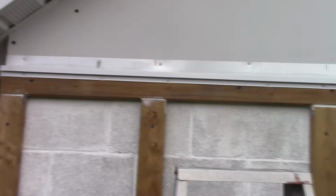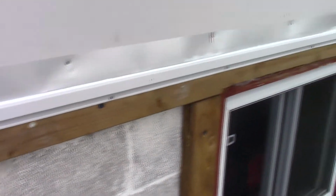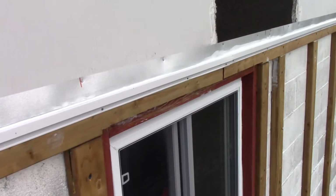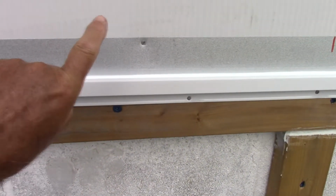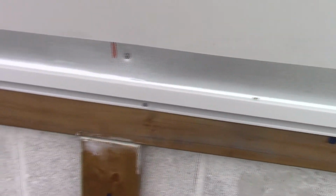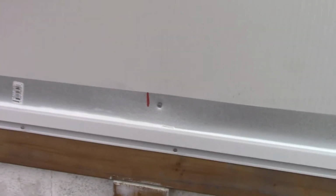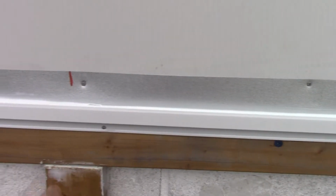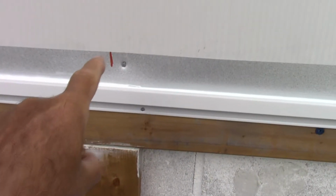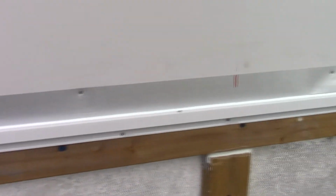And of course there's a big gap in the backside, and I'll show you what I had to do. As you can see there, I had to put some caulking in there all the way to the end, and that'll be good enough because I'm going to have to finish the other side next year. So I want that all to be weatherproof. And for this crack right here, all I'm going to do is just put some tape between here and here. And if you notice the lines, all the red markings match up with the studs, just so I know later that they're there.